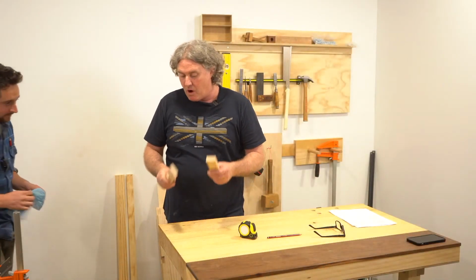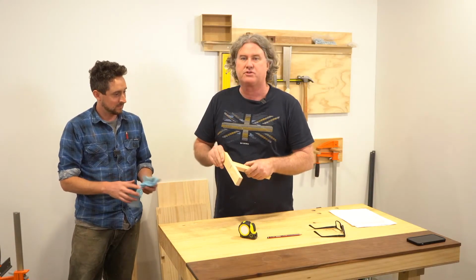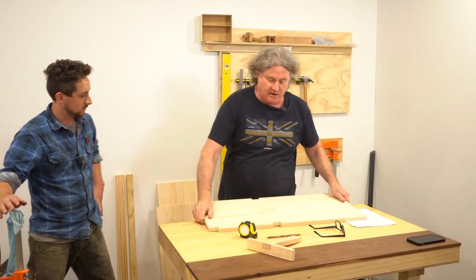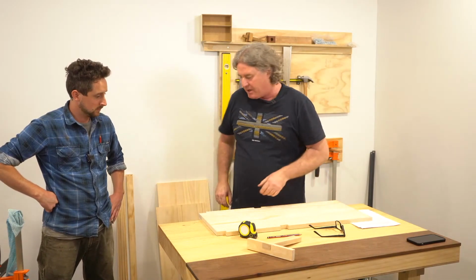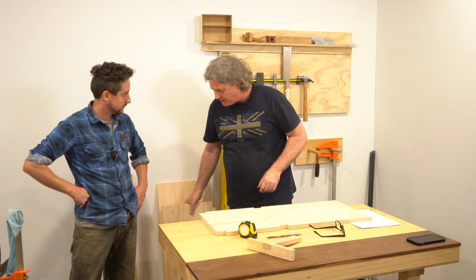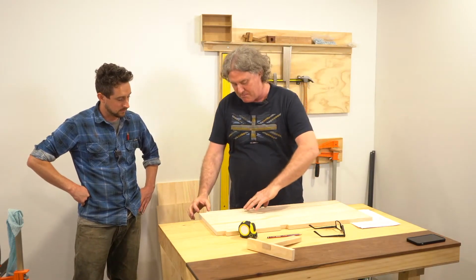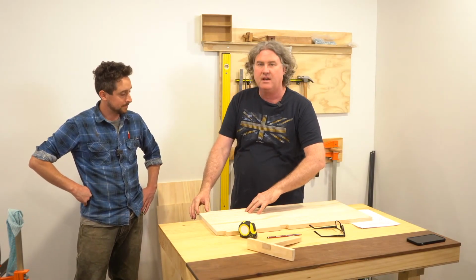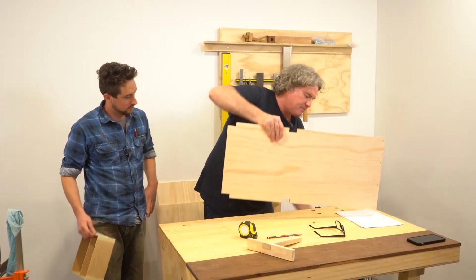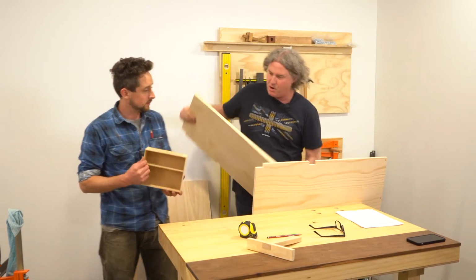Well, I'm going to make this rail and notch joint, all right? So in the interest of brevity, I've pre-made a couple of these, but we're going to make one to see a little bit of joinery technique here. A lot of people start marking out joints individually. What I did was mark out one pair of the joints and then transfer it to all the others so I know that they're all correct. So, for example, I'm just going to pop that there. And here's my blank edge.